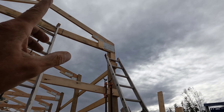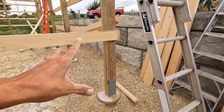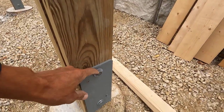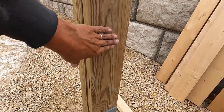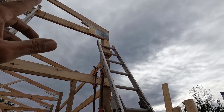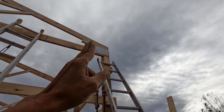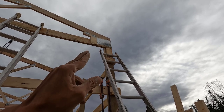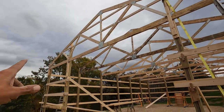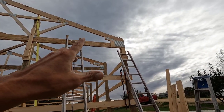I had planned on using half-inch bolts up there, two of them, just like this. But if I do that, this stuff is really hard to hide. I got tin that goes on the face of this. So what I'm going to do is when I go to town, I'm going to get big half-inch Spax and put one at the bottom and one up at the top. And I'll use slightly lesser Spax on these two columns here. So for now, that's plenty to hold that in place.